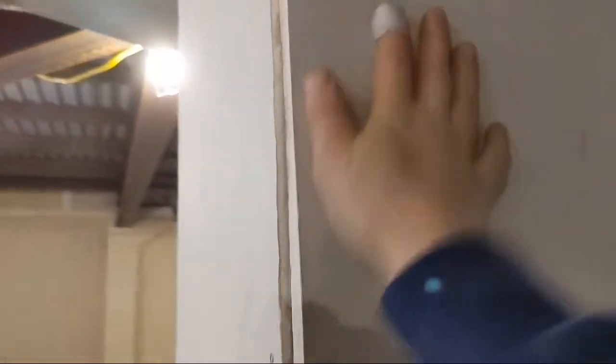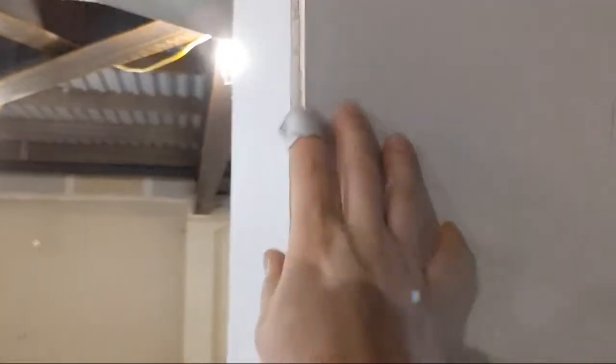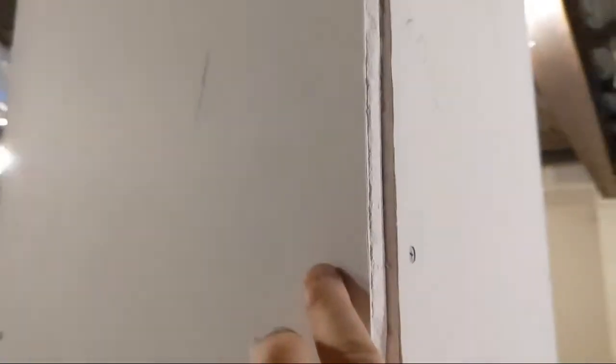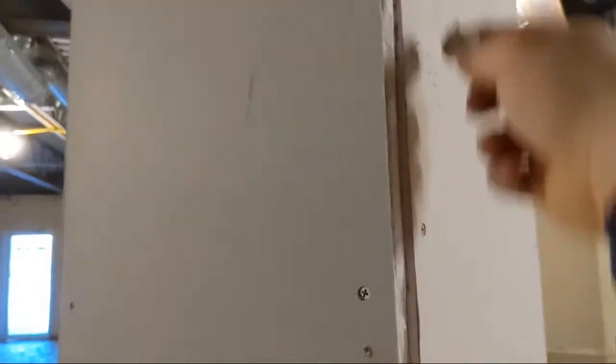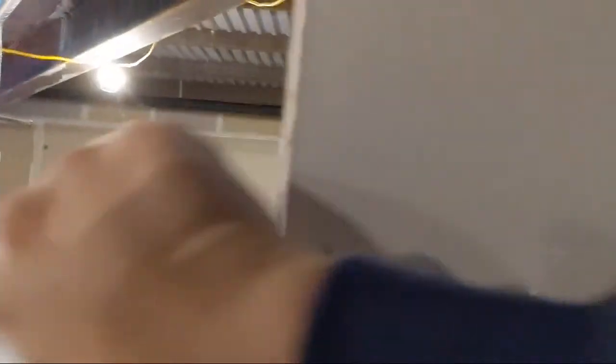This one's super strong. That other one's perfectly strong too. I put this piece of drywall on and I laser it in. I cut my drywall for the faces here a half inch shorter than the actual width, because you keep your corners a quarter inch back for your corner bead — a quarter inch for your corner bead.